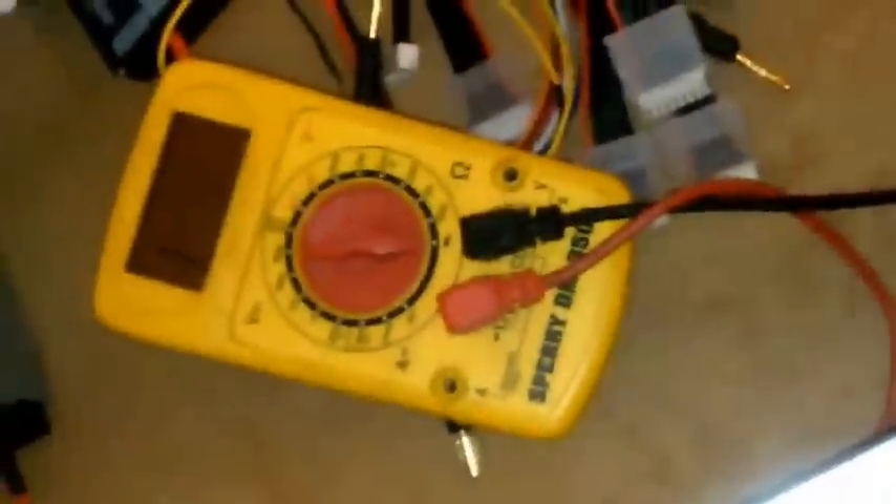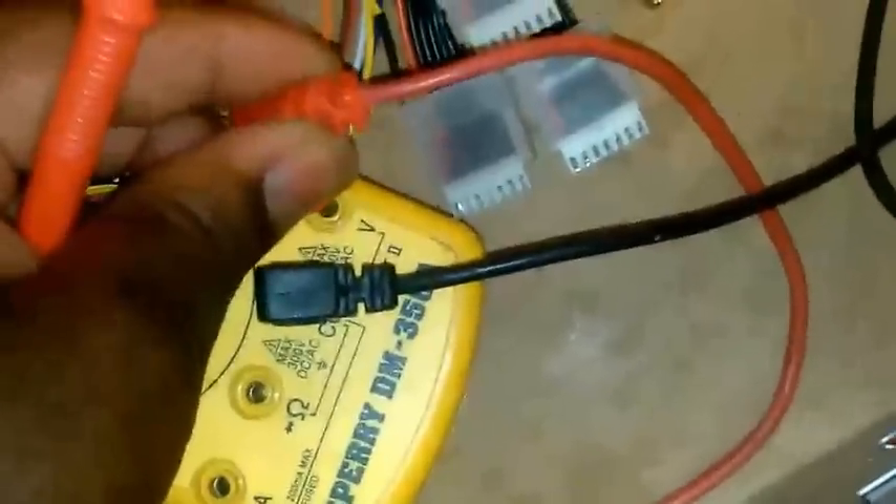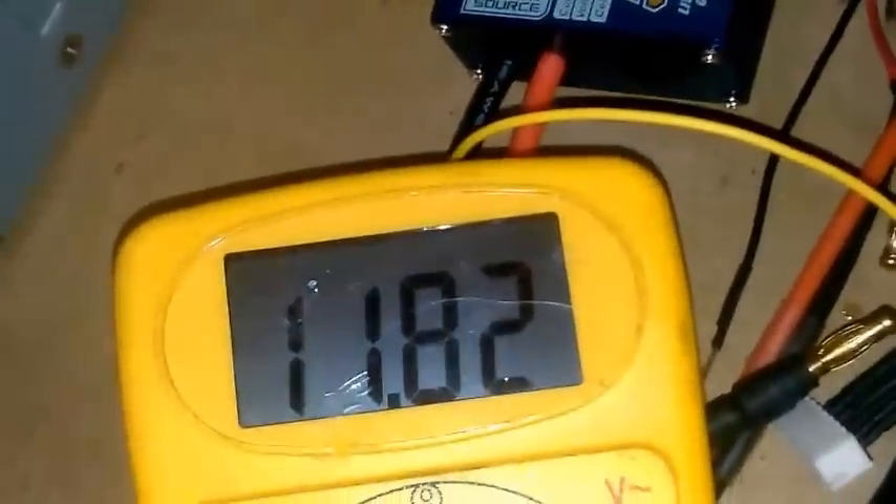So this one is ground-isolated. When you plug both E1 and E2 together, the chassis can be next to each other — they can touch metal to metal — and you won't have to worry about any shorts or the power supplies resetting or anything. Let me switch to voltage to show how much voltage this is putting out. It's reading 11.81, 11.82 volts. That's pretty good.